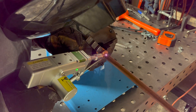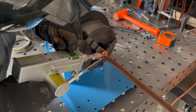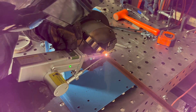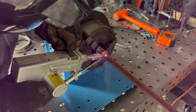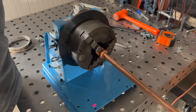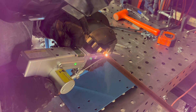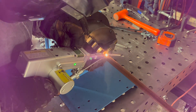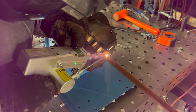The shield gas I'm using is nitrogen. I also know they were advertising that you could weld dissimilar materials with this laser, so out of curiosity I turned the wire feed on. As soon as the wire started feeding into the laser pool, it started to actually melt the copper along with the stainless steel, producing a weld that was as easy to do as any other material I've welded with this machine.